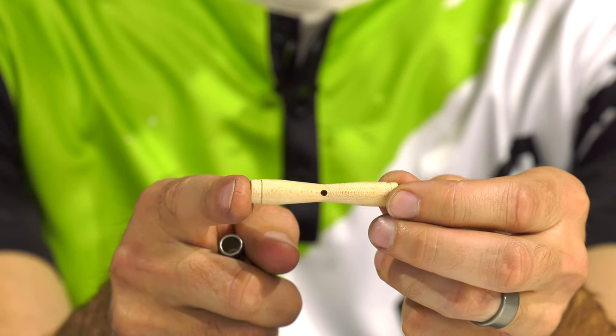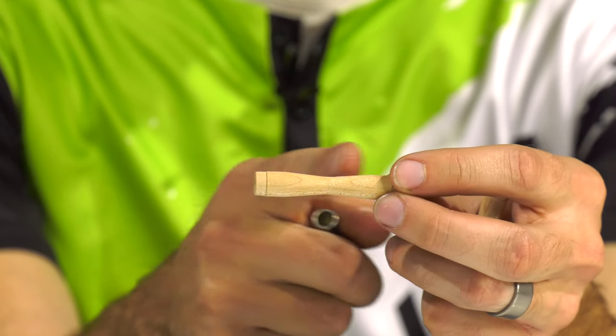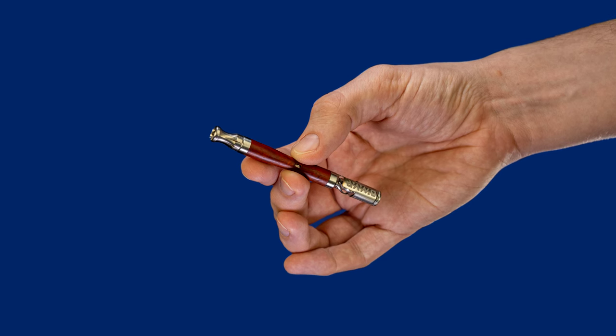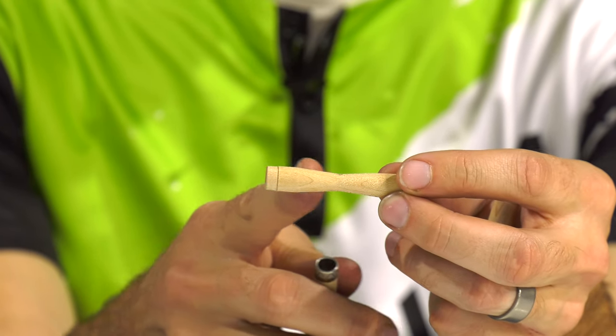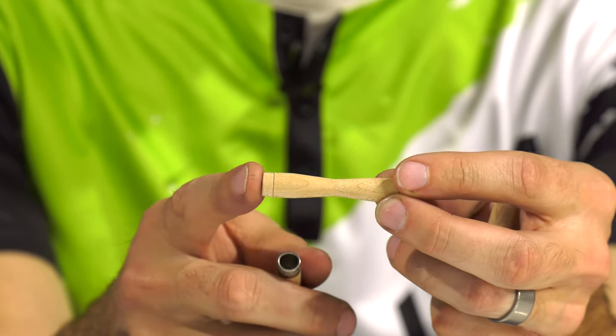This was the concept. What if we didn't go right down in the middle? What if we pushed the waist a little bit more to one end? We wanted to have enough room so that if you wanted to put an Omni mouthpiece and condenser assembly in one side, everything would fit. Something that feels nice in the hands, easy to finish, has good balance — not just the Thai Woody completely round. And at that point I realized we could draw the inside of the crown long enough that the entire area where any O-ring would touch would be completely lined with metal. It just feels like what people expect — they're used to holding something round, whether it's a cigarette or a pen or a pencil. It just feels good in the hands.